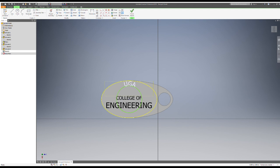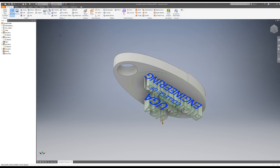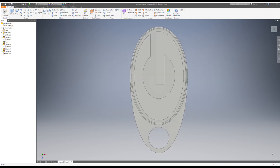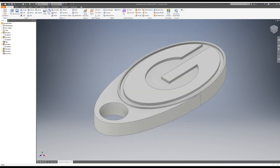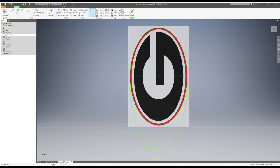The design process is very important since the mold has a large effect on the outcome of the product. Our first design had the injection point on the front face of the keychain and it was very large. This proved problematic when hand finishing the final product. The more refined design would have been to place the injection port on the side of the keychain, much smaller, so that the flash would have been easier to remove and its location would be less prominent.